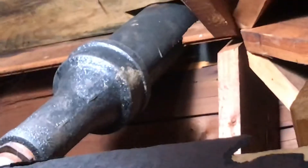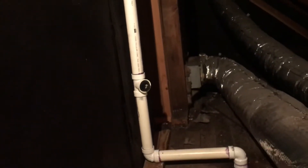You can see pretty much the position that it had to work in. The rest of the vent line is around here. You can see how the vent comes down with another 45-degree elbow that goes down into a clean-out tee.